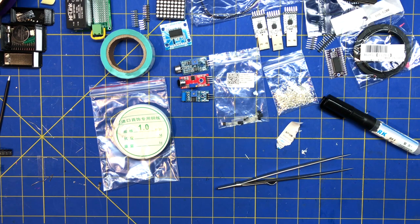Boards are dry and cosmetically clean. No residues to interfere with electrical testing. Improved soldering performance to minimize solder bridges. Flux is suitable for automotive, blah, blah, blah. Surface insulation resistance on the solder board is higher than provided by typical water-soluble fluxes.